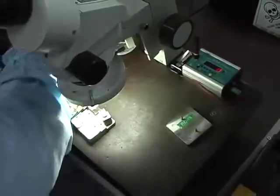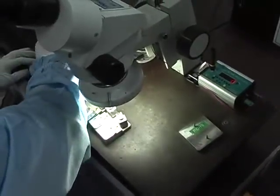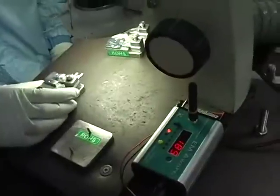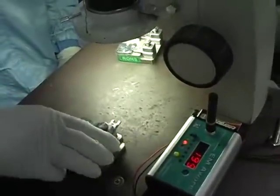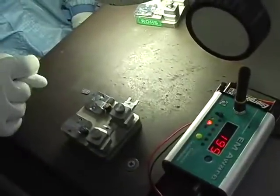At the soldering station, three tasks are performed. First, parts are loaded into the jig. Next, the flex circuit is soldered to the part. Finally, the parts are ejected by placing the holder onto a base. Each of the three tasks created ESD events.